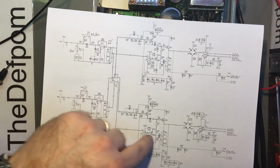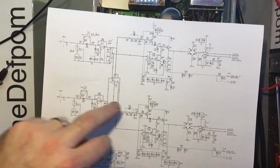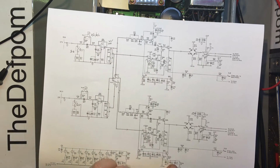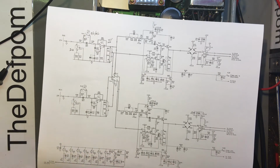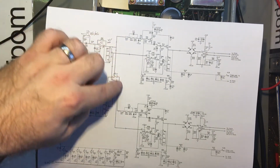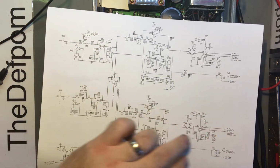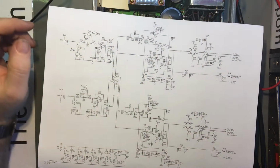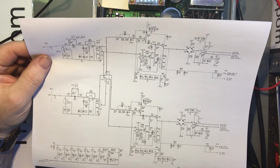So if it comes through this way, the trigger indicator is working. Right, because that trigger indicator comes from this section somewhere. I don't know exactly where yet. I haven't pinpointed that. All right, so it means it must be getting through here, through this relay into this section. But it means it must be somewhere after this point, where it's not triggering.